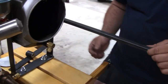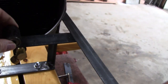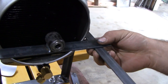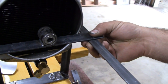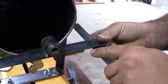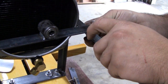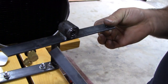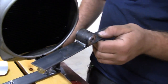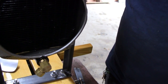We're doing a little brainstorming now. For the mounting holes, we're going to go with the oversized hole idea so we have a universal amount of travel — just an extra sixteenth in each direction. I can't decide if we're going to need a third leg down. I don't think so, because it's going to spin so easy. But depending on the RPM, that chain might want to resonate, because this bracket is rigid but does flex a bit.